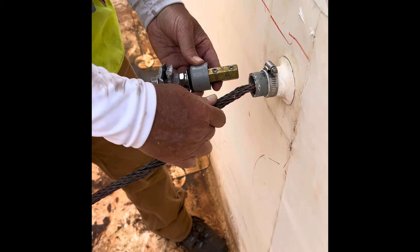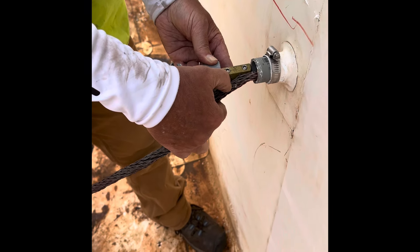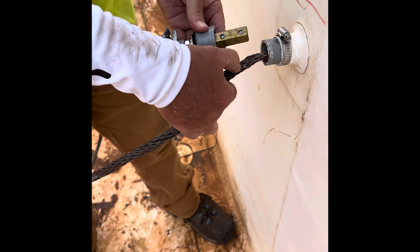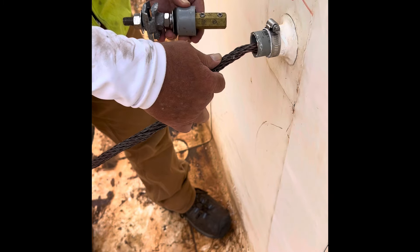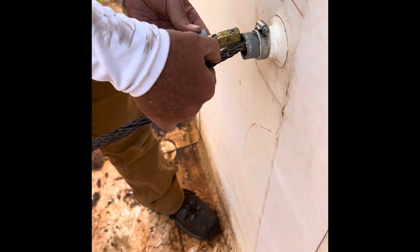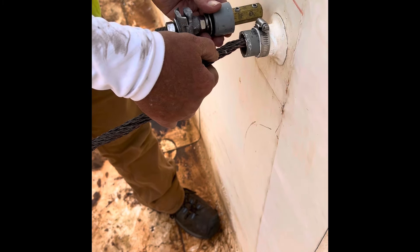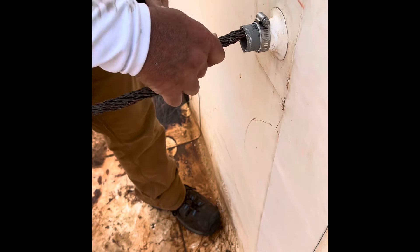The deal with these is you put it where you want it and cut it so both set screws grab the conductor. The problem is this is a heavy conductor — this is C54, it's what we use — you can't push it into the conduit. So if you cut it right here and clamp it down, how are you going to push it in and slide the cap over it? You can't do it, it doesn't work.